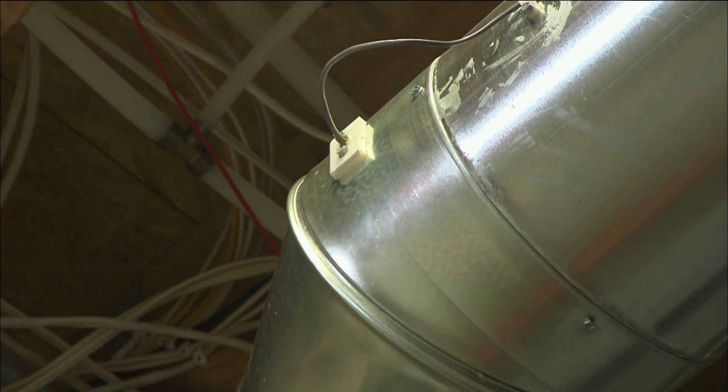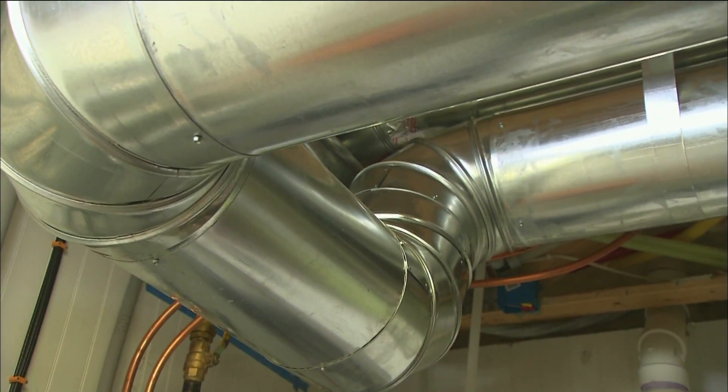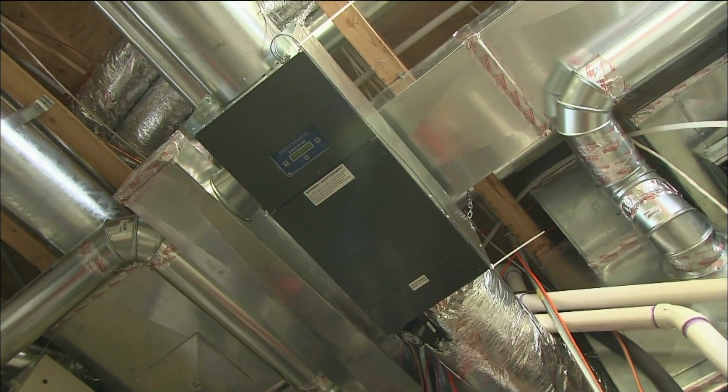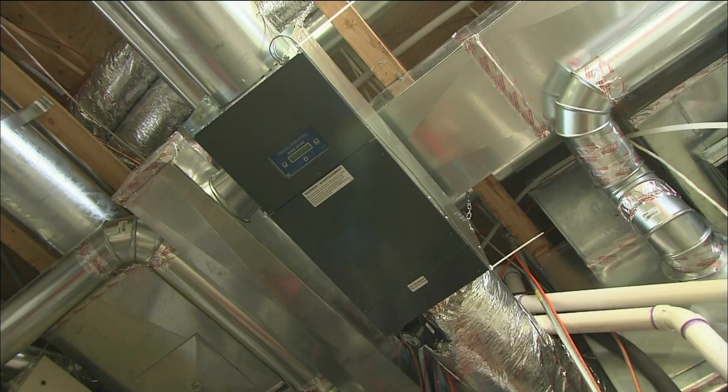There's a temperature sensor that monitors the air, and we'll use those heating elements to heat the air up to 50 degrees before it moves into the furnace system. The blower will also adjust to match the amount of air going out — depending upon where the speed is set on your vent hood, this unit will actually match what that speed is.